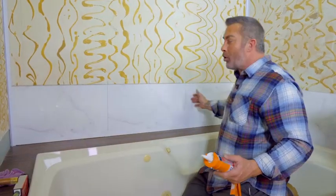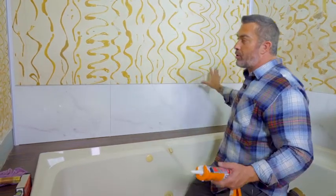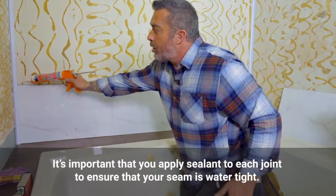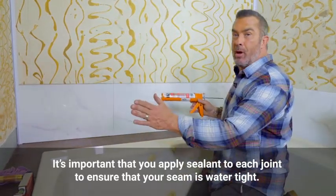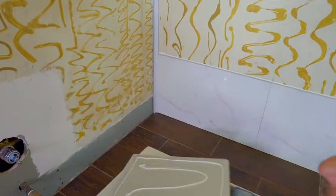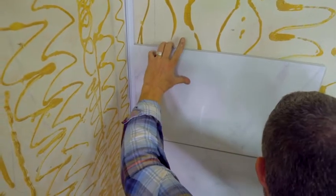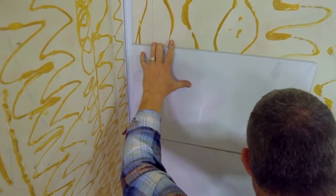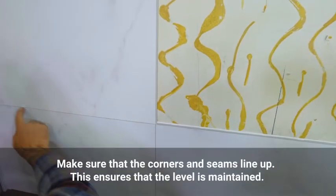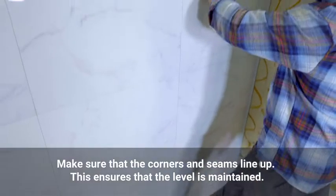Now I have the first course of tile installed. It's important that it's level down to the deck — we have a level line, the middle tile is centered on the wall, and two even cuts on either side. The process is repeated all the way up the wall. It's important that on each tongue and groove joint we apply sealer to make a nice watertight seal on every joint all the way up. I'll go ahead and seal this top line, then with glue on the first tile of the second course, slide it into our inside corner track and work it down into the tongue and groove joint. You can see our corners and seams match up nice and tight, giving us a waterproof seal, keeping us level all the way up the wall.